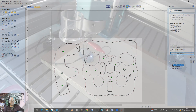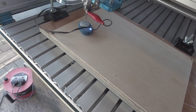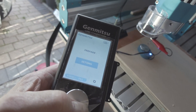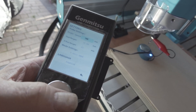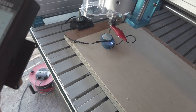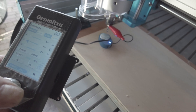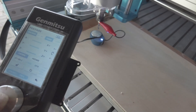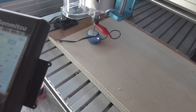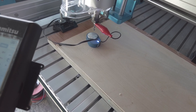So we'll go to the machine now. Here we are at the machine. The file's been loaded. Don't forget when you do this and go to the settings on the offline controller, you must make sure that that's in three-axis mode, because you're not using the fourth axis. Go back to that — Prepare — and I'm just going to do the touch-off probe. There we are. That's that job done, so I can release that.